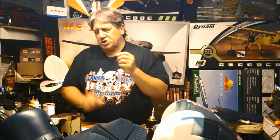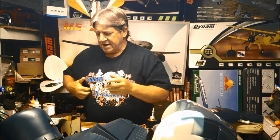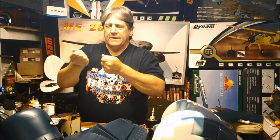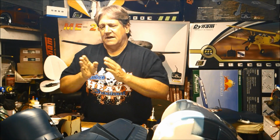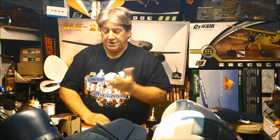You just need to put the screw on and get that all set up, and then put a dab of that at the back side of the screw, behind the nut, so that the nut can't thread itself off and fall off. There's no strength there. It's not a strength type pulling kind of thing. It's just to keep the nut from falling off. So a little dab of that on the threads behind the nut is all you need. And that'll be fine. It's not going to fall off. And that's all you really need.